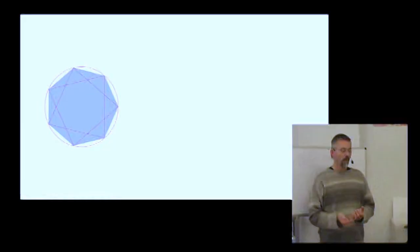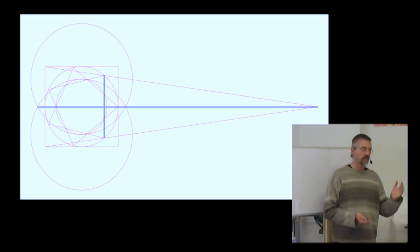This sword was based, as I said, on the number 7. Within the circle, there is a 7-pointed star. I can construct a square around the circle. And again, from the very first disposition you saw, we can then establish a total length and a division between hilt and blade. So we get sort of a basic proportion for a sword. Now, I can draw a circle in the inner corners of this 7-pointed star, and from that circle I can construct a vesica. It projects the length of the sword a little bit outside the square.